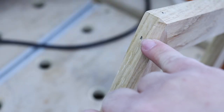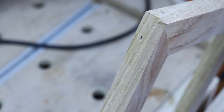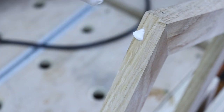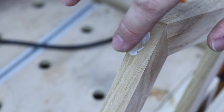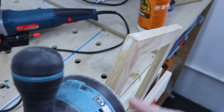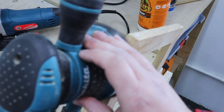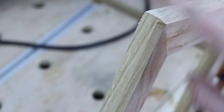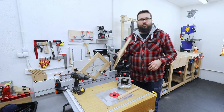As you can see, the head of the nail has actually gone through, so we've got a nice little void here that we can fill in. Add a little bit of glue and now we're going to sand it off a little bit without the shop vac connected, so the dust will remain in that void. Check that out — it's hardly visible.